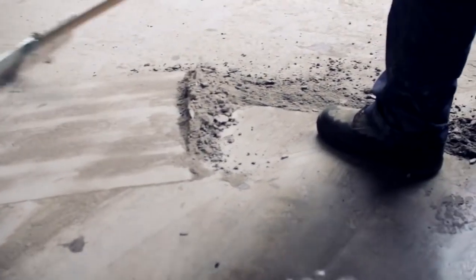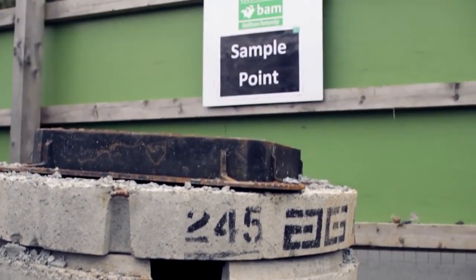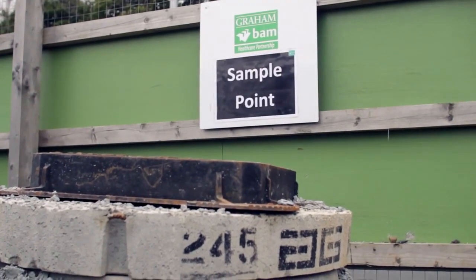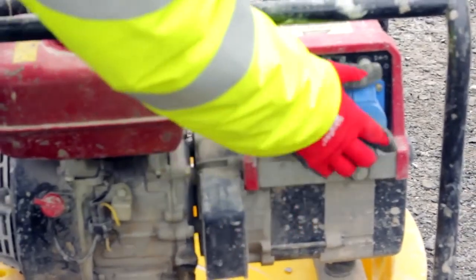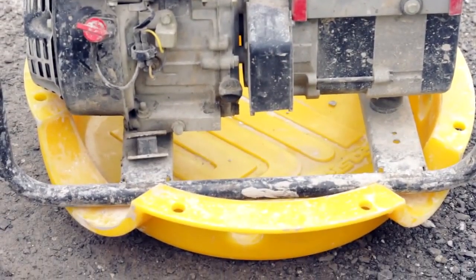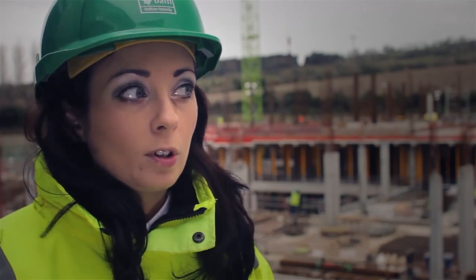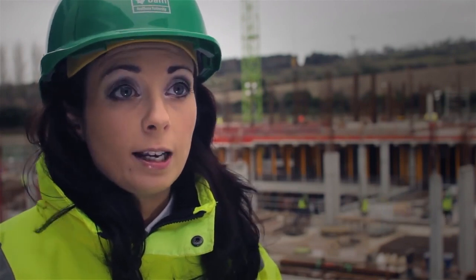We carry out visual inspections of any water courses adjacent to the site. We would also use plant nappies under machines that have potential for spillage. It just means that if there is an accidental fuel leak we are able to capture that and it can't penetrate into ground water. Other than that, it's the likes of the sediment tank that we're using — a bespoke system that we have come up with ourselves in order to filter any sediment that might have built up in the water that we collected.